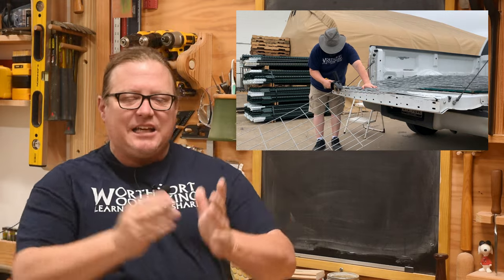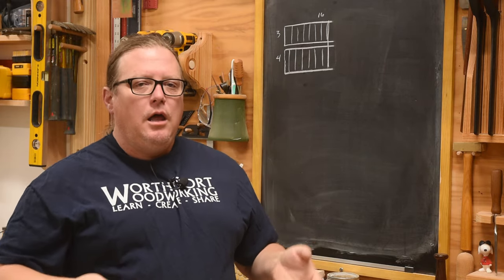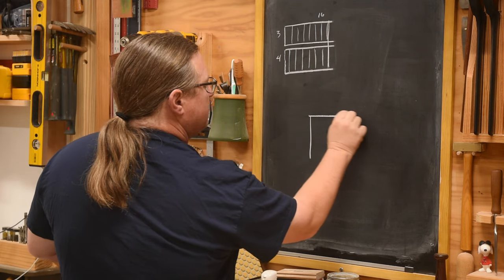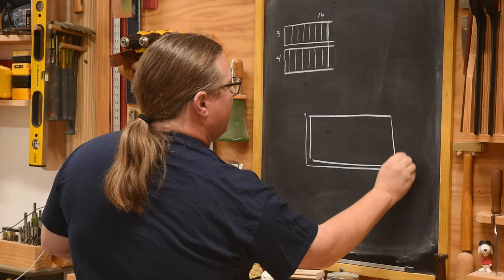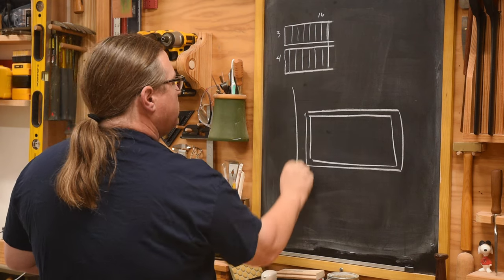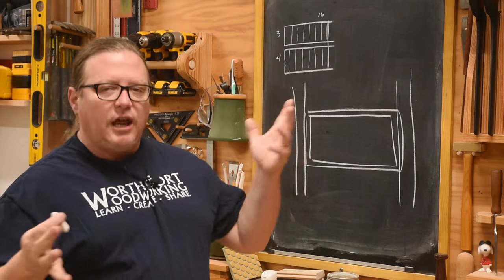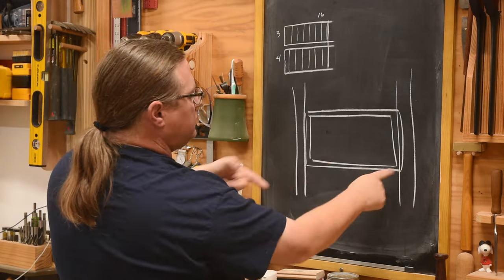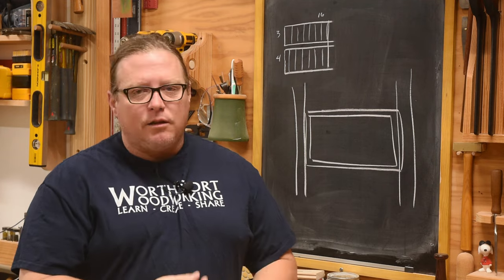Now, if you understand how they're made out of squares, I can't take a 16-foot section and make it a perfect 8-foot. It's going to be a little bit less than 8-foot just because you have to cut out a square. But I believe by having an 8-foot section wrapping it with 2x4s all the way around, and then having a post on the side, I should get close to pretty much 8-foot sections. And that's what I mean by frame and panel. The posts and the 2x4s will be the frame. We'll just drop the wire right down the middle.